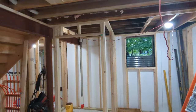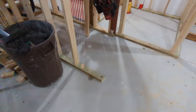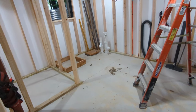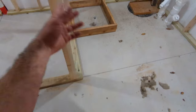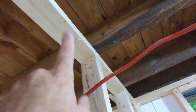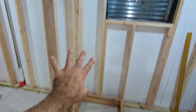We got this pretty much fixed and straightened out, changed. I think it's for the better. I don't think anybody's going to miss the angled wall there. They look cool, but like I said, as soon as Ed started saying, well, we could live with it, we could do this or that, this was a matter of an hour or two. I ran into stupid issues, otherwise it would have taken an hour and it would be done. But I'm out of treated, so I turned this plate around and used the complementary angles, butted them together to get it to go straight. I did the same thing up here for some strange reason. Oh, because those were all already nailed up and I just left this alone. That was worth doing.